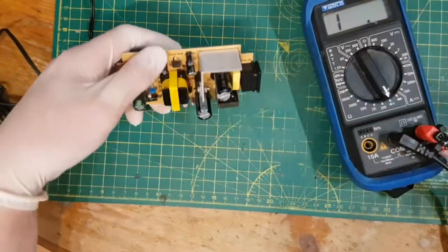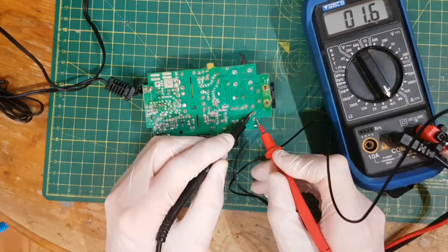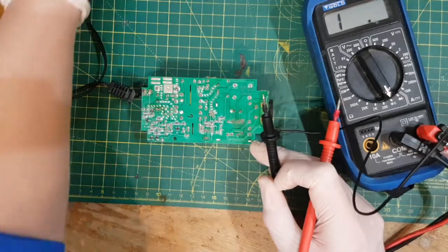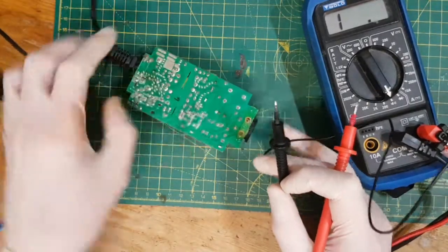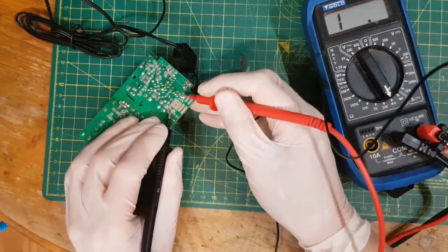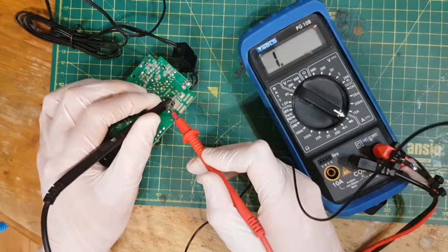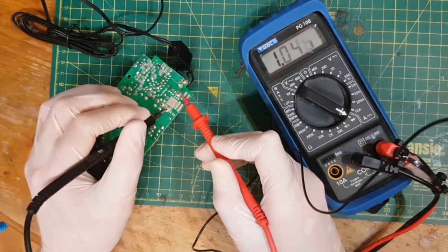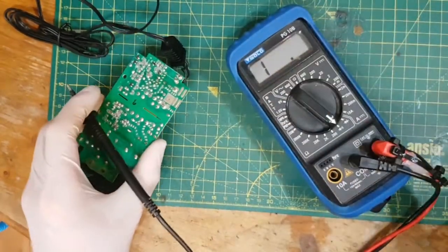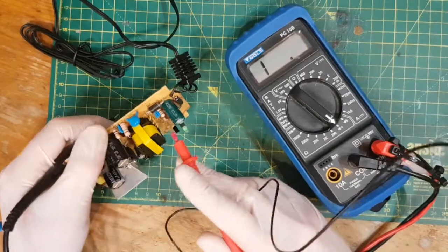Let's go to continuity mode. That's the fuse — I bet that's gone. No, the fuse hasn't gone. Let's check the output diode here, which is this guy here. And the output diode has gone — the diode is bridged. What you should see is it should go one way, not the other. That clearly isn't the case here because it's bridged. The diode's gone short. And it could be the diode, but it could also be this capacitor. So either the diode's gone short on the output, or the capacitor has.